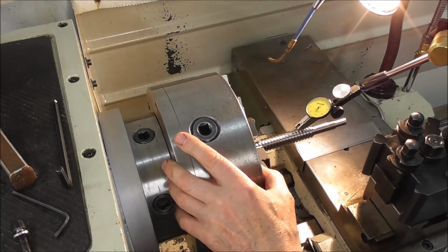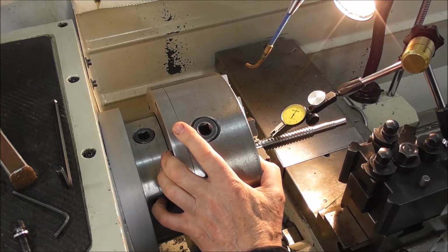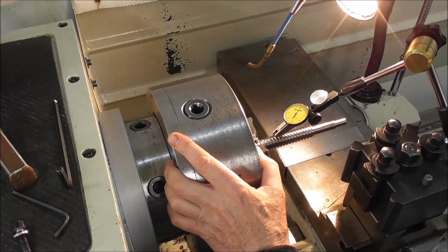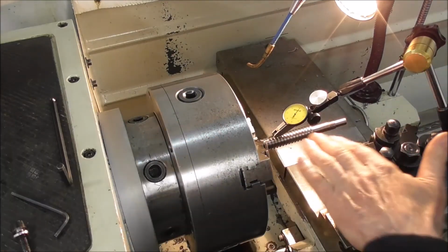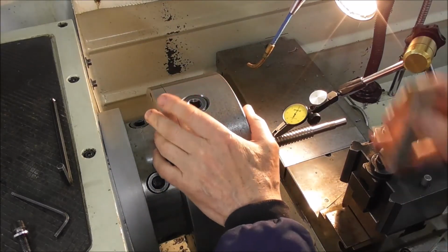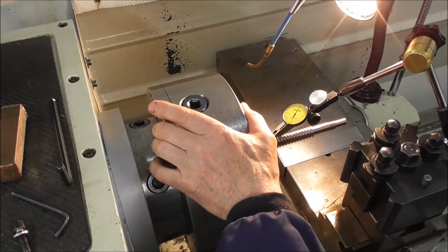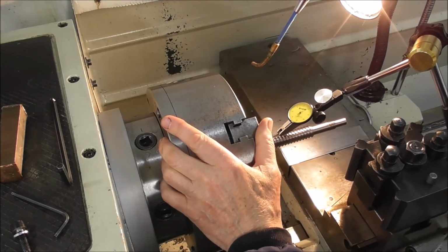And I can easily make the adjustment. So come down one end, just checking you can see me okay, and come to the crest of the thread and turn it to the next spring loaded screw, to the crest of the thread, and then on the high point of the screw, because the weight of the chuck is bearing down, it's easy. Oh, did I just bump it then? Hit it with a bit of copper or something like that and just give it a wee bump, and you just tap it down with the gravity of the chuck assisting you, and then come down the other end.